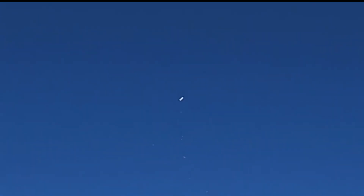We got back to the shop and watched all the video footage — it turns out we caught the entire explosion event in frame on camera, so we're showing that in slow motion. We see the rocket flying perfectly fine, and then boom, the motor explodes. The rocket starts spinning end over end, and the centrifugal force seems to shoot the nose cone off, which then pulls out the parachute. Right after the parachute deploys, you see a little explosion and puff of smoke — that's the ejection charge exploding — and then the rest of the rocket comes down beautifully on the parachute.